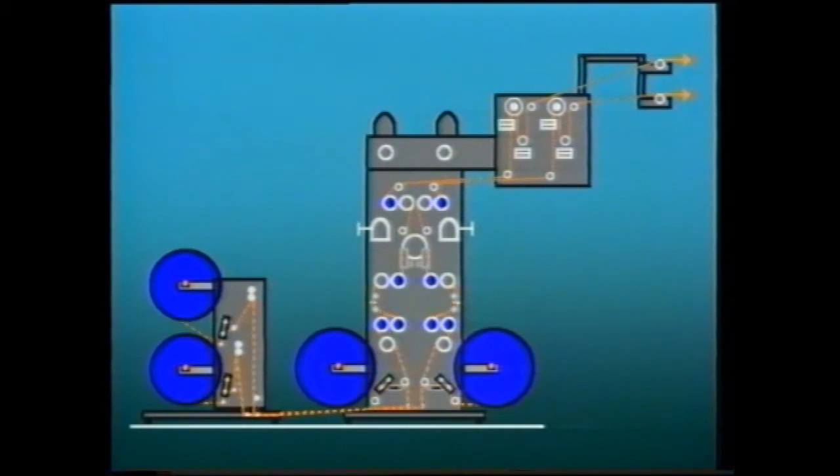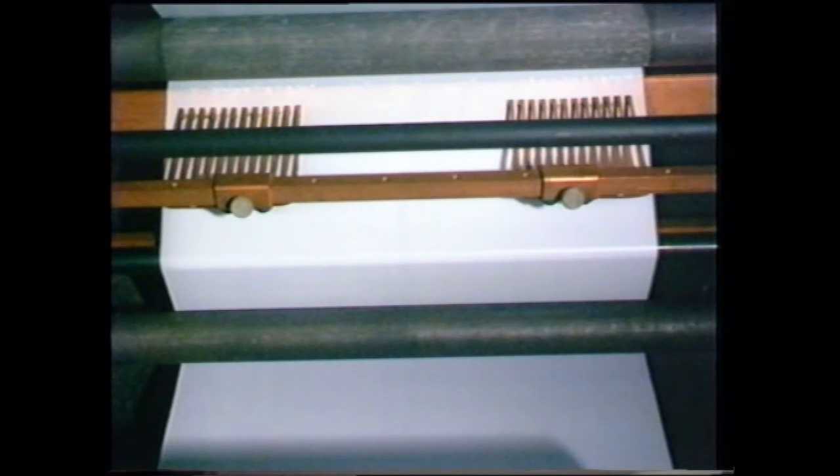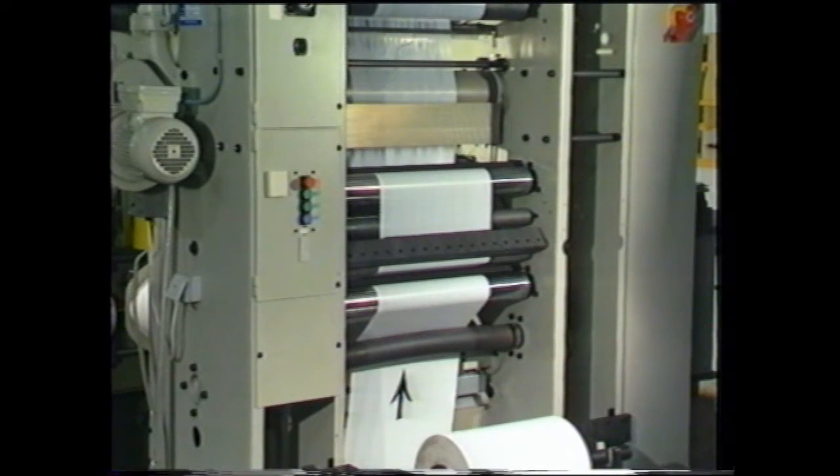A double-ply primary film roll is fed in on both sides of the EZO unit. If required, a single-ply film roll can also be fed in. For this purpose, an additional film feeding device is available behind the machine in order to obtain the required number of tapes. The film is drawn off from the film roll and passes through the defect and selvedge scanning device to the film preheating system and selvedge spreader.